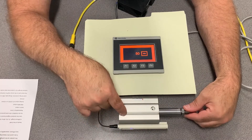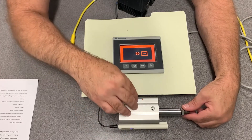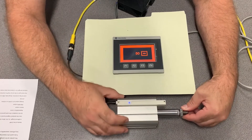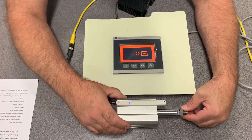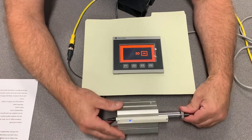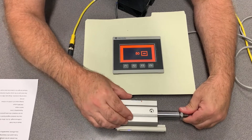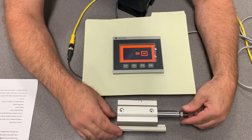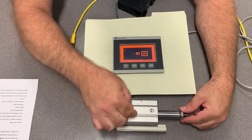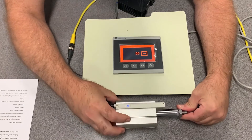This is going to be a solid-state PNP or NPN sensor, or it could be a reed. The cylinder already has the magnet in it, so the advantage is that this reads the same magnet your typical sensors would operate from. Also, what makes this sensor work so well on a cylinder is you don't have to bore a rod or do any outside modifications. If it fits within the same groove a typical sensor would fit into, you can pick from the different cylinders available.